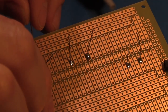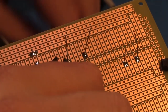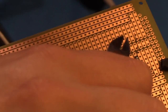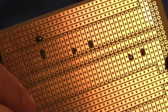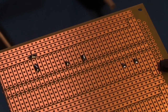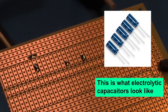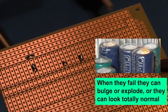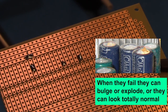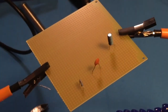After soldering you cut off the leads. Next we're going to desolder. Desoldering is the hard part but it's actually a very useful skill. When working with old equipment, the electrolytic capacitors tend to fail — components can fail — and you want to remove and replace them. A skilled technician should really be doing this, but with enough practice you can learn to do it yourself. Here are three components that we're going to try to remove.